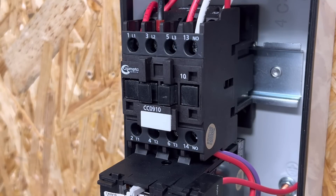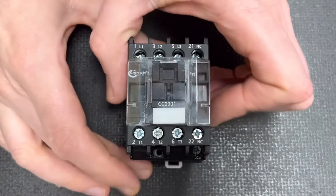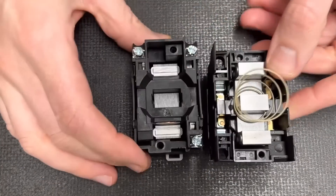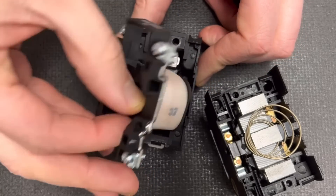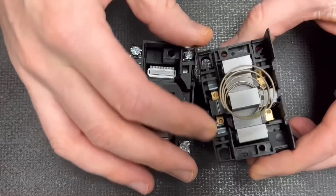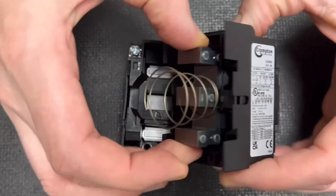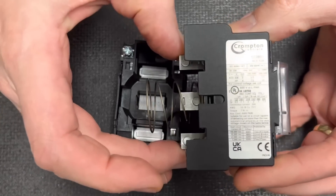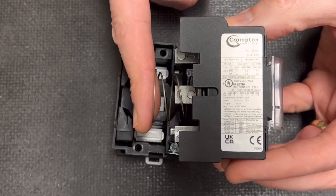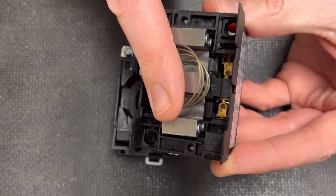For one thing you'd have to have the lid off to access it — very dangerous. We get it to work by energising the coil in the back of the contactor. Inside the contactor there's a coil of copper; when this is connected to the supply it generates a magnetic field. Mechanically connected to the switching bars is a soft iron armature, which is attracted into the magnetic field. When it moves into the field it pulls the contacts to the closed position and current can flow to the motor. Then when the supply to the coil is turned off, a spring in the base of the contactor pushes the armature and contacts out of the electromagnet and disconnects the supply to the motor, thus turning it off.